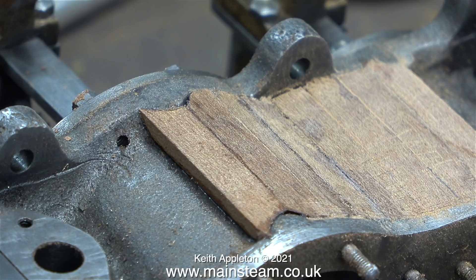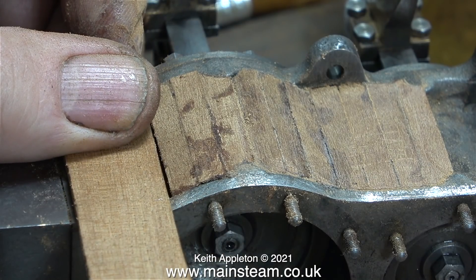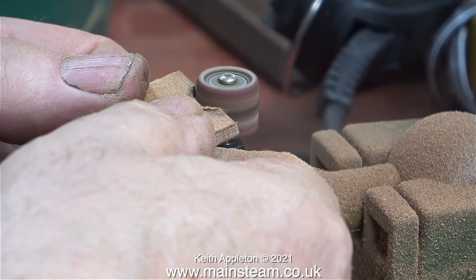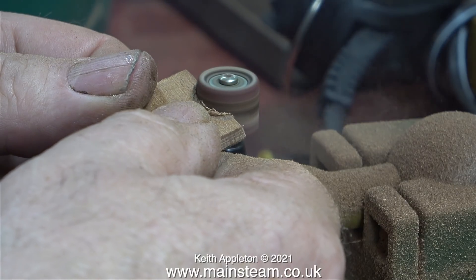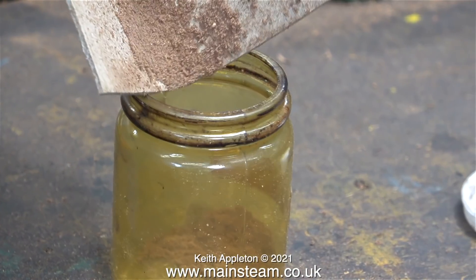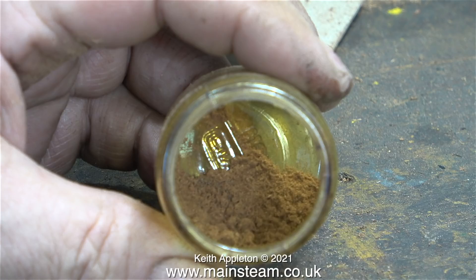This is the interesting bit because the mahogany goes up and around the cylinder, so each piece of mahogany needs chamfering at an angle to fit to the one next to it. I'm using a larger piece of mahogany to make the part that fits around the exhaust flange, arriving at the shape by looking at the casting. This made a lot of mahogany dust which I collected and tipped into my pot of mahogany dust — this makes a great gap filler in between the mahogany parts.